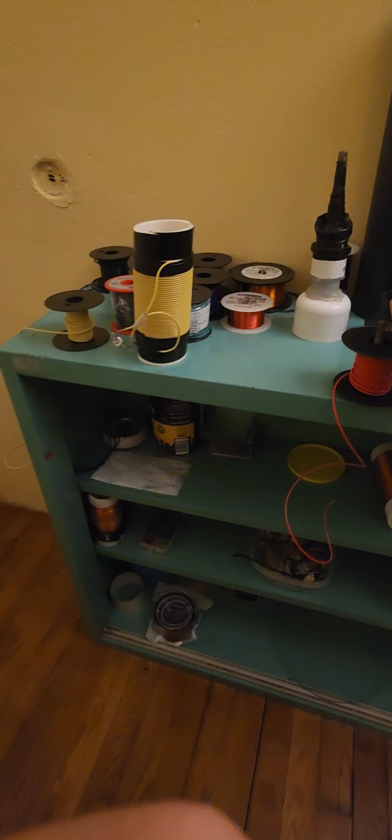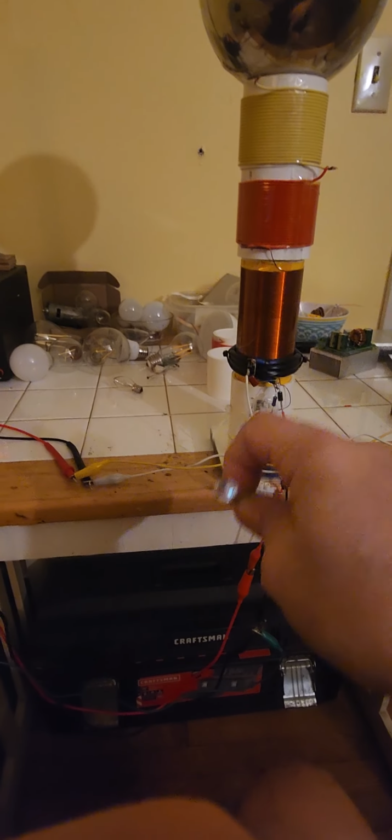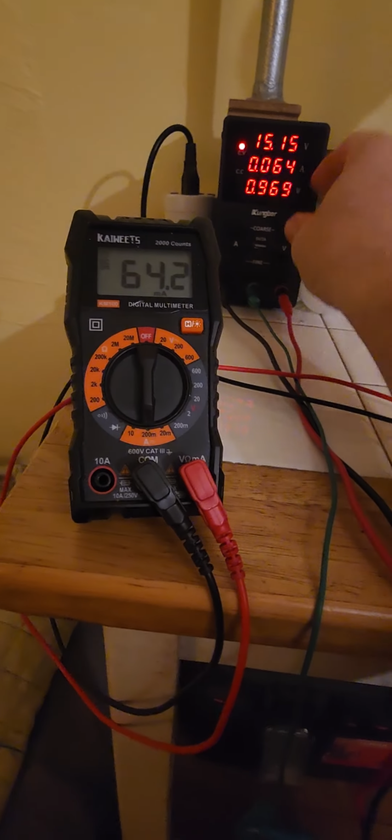So our receiver coil is getting, from this transmitter, which is being supplied by the DC power supply, 37 volts at 75 milliamps. Now that should interest you. We're at less than 1 watt. The transmitter is using less than 1 watt of power, dead short on the receiver, and we still have wireless power. This resonant receiver does not affect the transmitter's output power in any way, because it's a separate system.